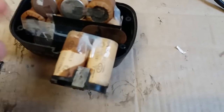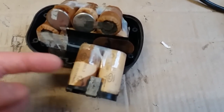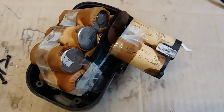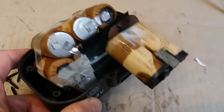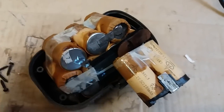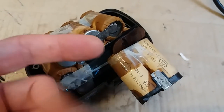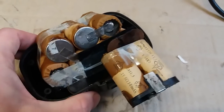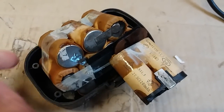The batteries look quite horrible — could they be reusable? Nickel cadmium batteries in older tool battery packs tend to have paper isolation instead of plastic isolation, probably because it's more heat resistant, but it soaks water, so it's a horrible mess. It's basically 12 cells in series and nothing else — no protection, no temperature sensor, no balancing. Nickel cadmium cells don't need balancing because the one that's charged more will just dissipate the extra energy if you keep charging. Any protection is probably not necessary either because these batteries don't really mind being discharged to zero.